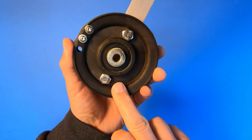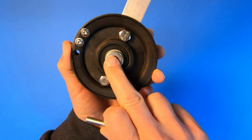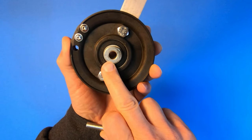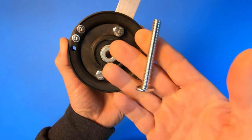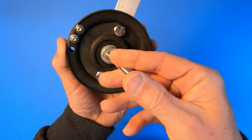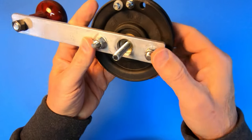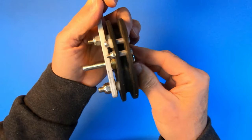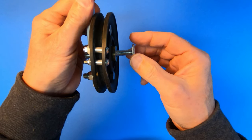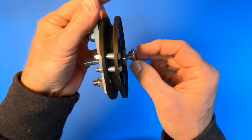One of the decisions you'll have to make is what size bolt to put through here. This is actually sized for a three-eighths, but you'll have to grind off the bolt head to get it into the track. So I'm just going to use a five-sixteenths, which has a little bit of slop in it, but I don't think that's going to make any difference. Fred cautioned that there's a lot of force put on this and he recommended using the full three-eighths — we'll see how that goes.